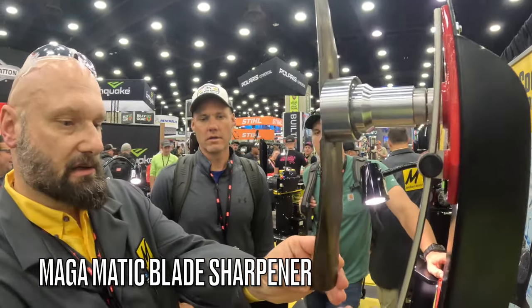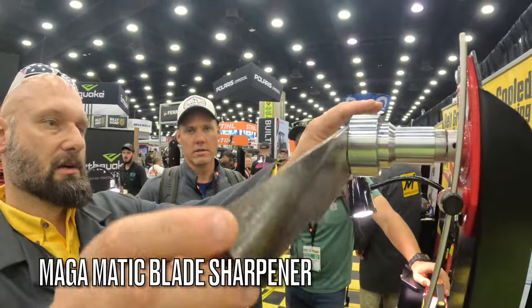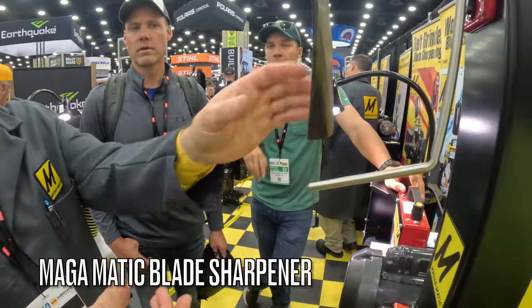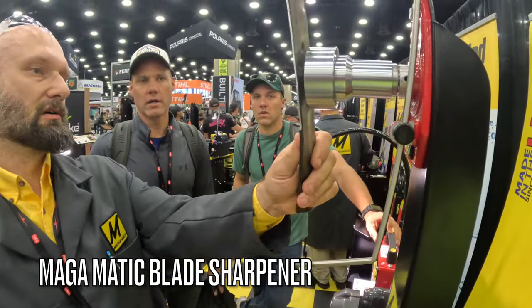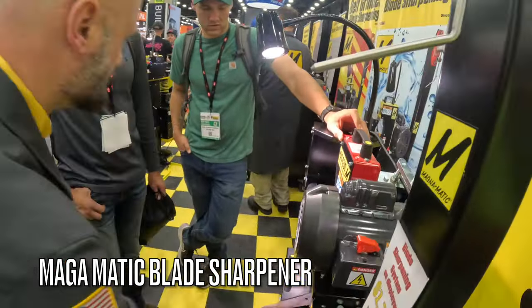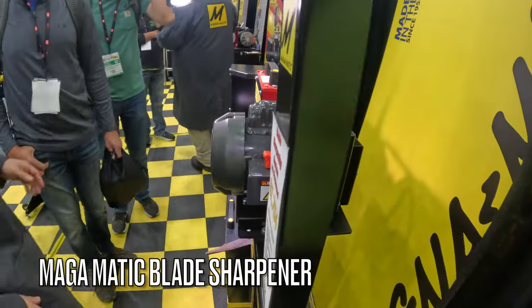And then the rod here is for checking the straightness. You touch off on the back of one edge and you come around and check and see if there's a deviation so you can check the straightness. So that's why you can't just come here and go something random, right? Yeah, gotcha. Can you sharpen that blade for us? I can certainly, give me a second with some gloves.